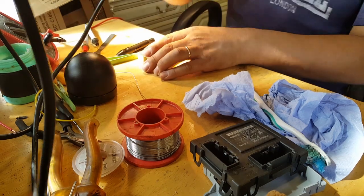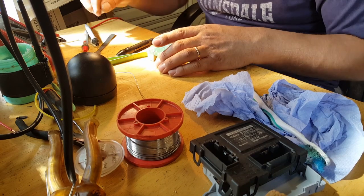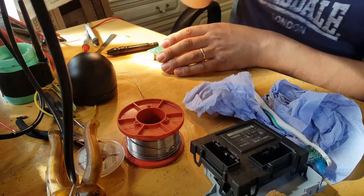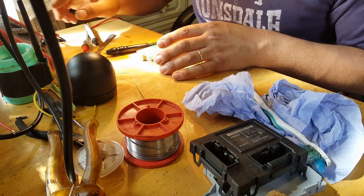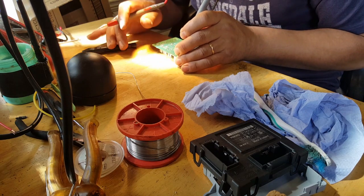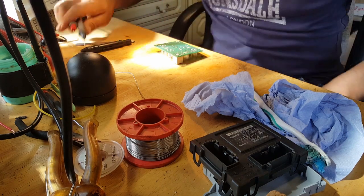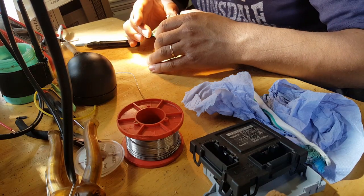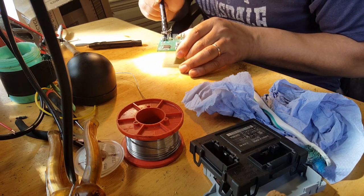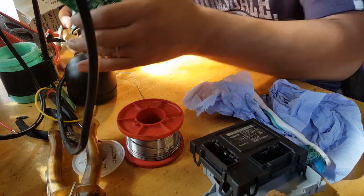I think I got it this time — definitely I got it. Let's just trace these lanes: it goes through there, straight to the relay itself. So let's check for continuity. That's the relay leg — spot on. It's done. Now, as I said, I'm going to re-solder this area that had water damage as well — three capacitors that were under those conditions. That one needs a little bit of solder too.